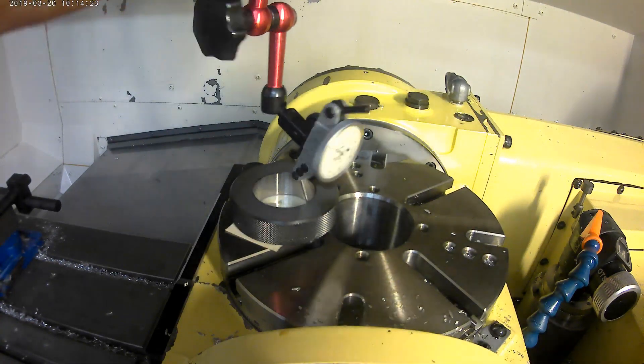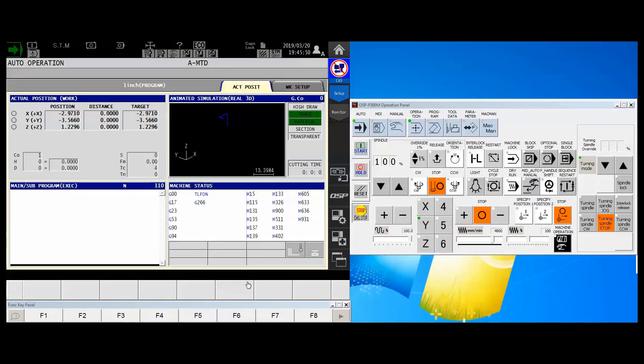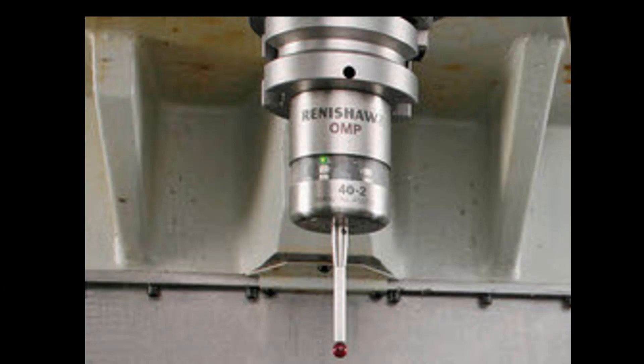I don't want to have any kind of variation whatsoever. Once I find the exact center of the ring gauge I'm going to translate that into a work offset. If I'm not already looking at the operator screen I'll push the operations button on the control panel and then find the work setup tab on the upper right hand corner of the screen. I'm going to pick a work offset that's not already being used — in this case number five — and by tapping Select, Zero, and OK, that's now the current active work offset displayed in my position screen. To set it I'll select X Calibrate Input and do the same for Y Calibrate Input. Now the X and Y for work offset number five are set to be the center of my ring gauge.